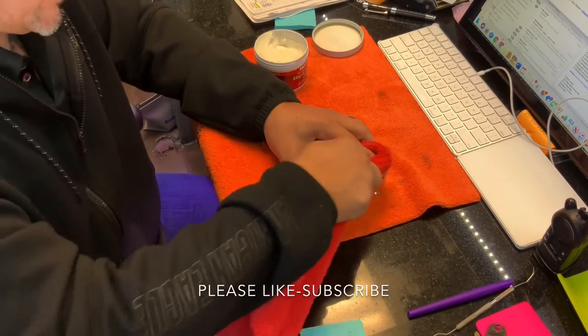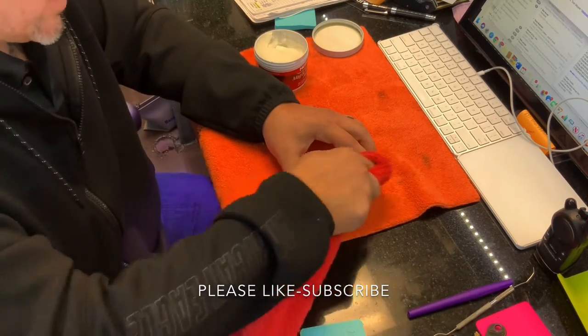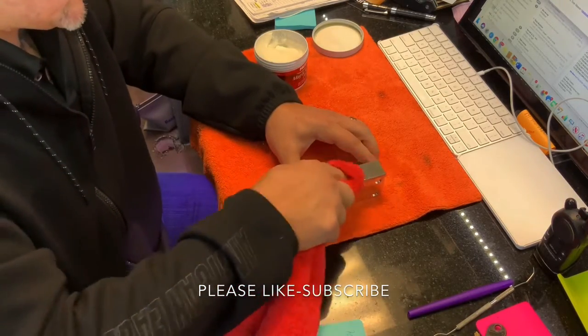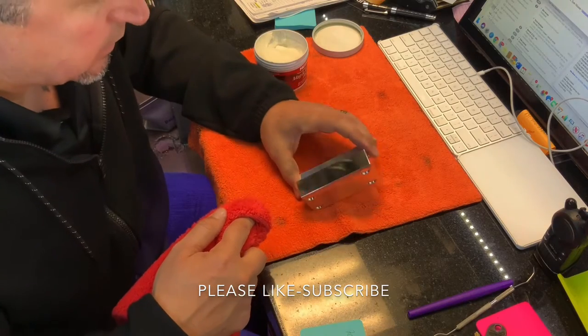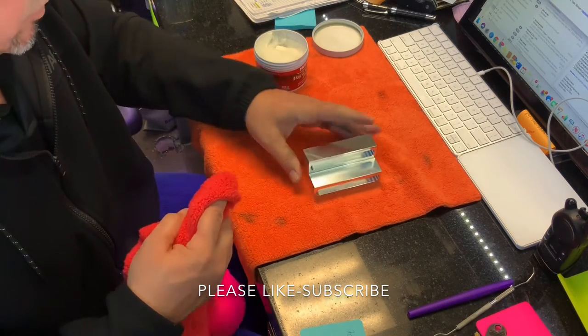I'm not pushing that hard. I'm not looking to remove any scratches or anything like that. If you push too hard, even with a super soft towel and the best polish in the world, you can absolutely scratch aluminum with it — no problem. I like to do it one plane at a time. I see some pits or little machine marks here, so we may have to go over that again. It looks a little rough. This one I won't be selling based on the tool marks I can see in there.